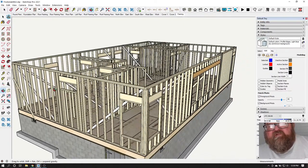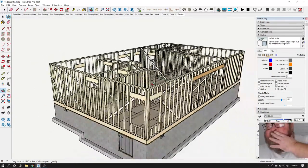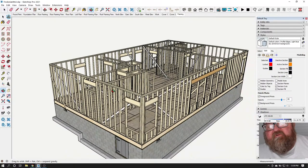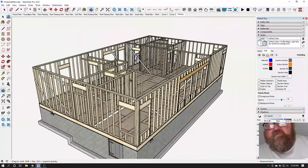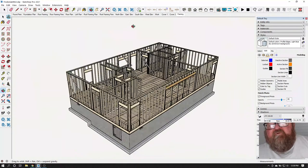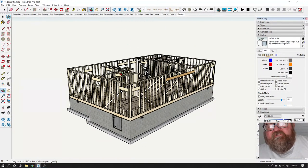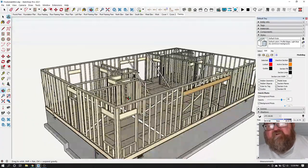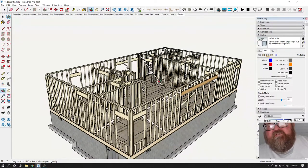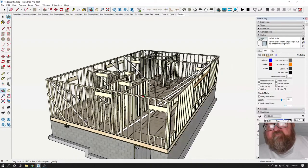You can go around and put all your wall sheeting on — that will exponentially make your perimeter walls sturdier. I've set trusses before with a boom lifting them up there, and the crane is dropping trusses and bumping the house, and then you've got to go back down and check the walls for plumb. There are a lot of forces on these walls until you get everything framed up.